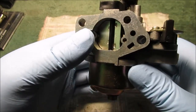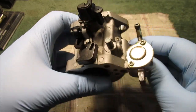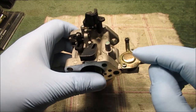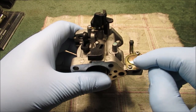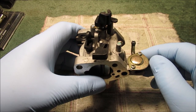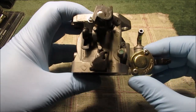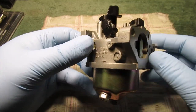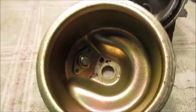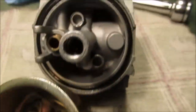Let me take my glasses off. This is the Greyhound — it's not a Predator. It was the Honda clone, Lifan Corporation — look it up on YouTube. Here's your fuel shutoff, it's got a thing with four holes, kind of like a sub-motorcycle style. When I first bought this engine I had this out twice the first day on the tractor because it wasn't getting any fuel. This engine has been ours since 2011 — we've run it eight years. Let's get this part — it looks dirty inside.